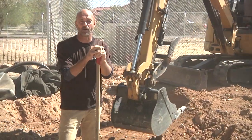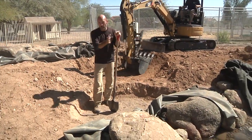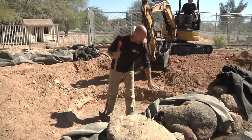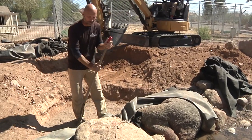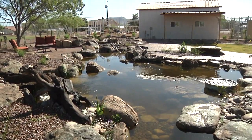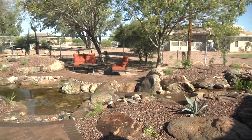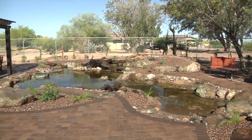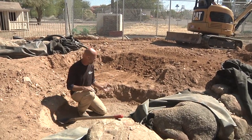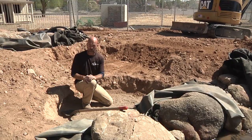We just finished excavating the area for our waterfall. Some design tips to think about when doing a waterfall: think about the water course itself and the different viewing areas. Starting down at the bottom, we have this narrow joint where big boulders come together. This is a long pond and we're trying to get a push of water over here — a short waterfall with thick water coming in, creating a big push towards our skimmer area and keeping the area in front of our beach clean. Right behind those big boulders, we're digging out a pocket — a plunge pool. We'll have a big wide waterfall falling into this pool with lots of turbulence facing right towards our patio area.